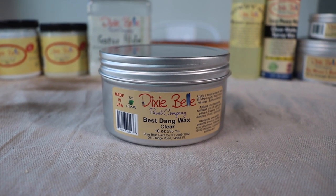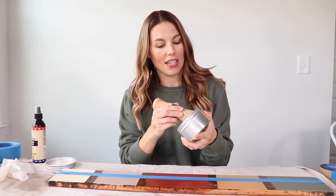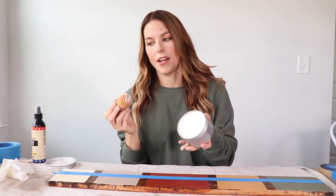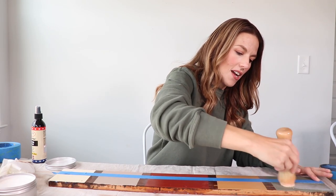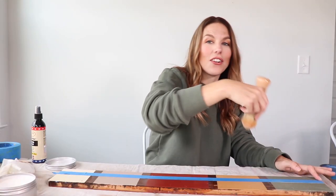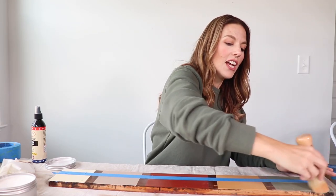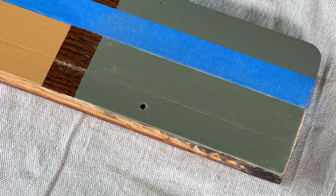Wax can be applied with a brush or a lint-free cloth. I'm going to use the Dixie Belle La Petite brush to put my Best Dang Wax down on my Juniper color. Dixie Belle's wax is water-based, which is unique — it has no odor, which is really nice. I recently used this on my 24-hour flip challenge and I forgot how much I love wax. When doing wax, you really buff it in and rub it in — you want it to absorb into the paint. Another great thing about wax: if you want to add some dimension with color waxes, they layer really well on top of each other. And if you want to distress your piece, you can still distress after you wax and it's going to look really pretty. I'm going to let this set for a little bit and then wipe it back in a few minutes.